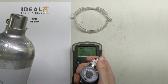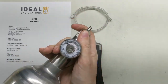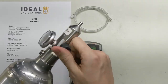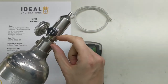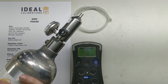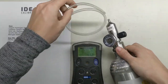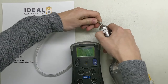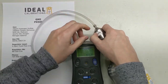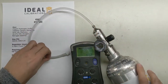Let's get this regulator screwed in. First step is opening the regulator, then back it off a little and screw it into your cylinder. Once it's screwed in, go ahead and close the regulator valve. Opening it first makes sure any air or moisture in the space purges out rather than going back into the cylinder — moisture combined with hydrogen sulfide can cause the H2S reading to fade on you. Now put the calibration tubing on the regulator, and don't go past that second bar on the fitting or it becomes a real pain to remove.